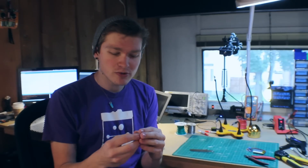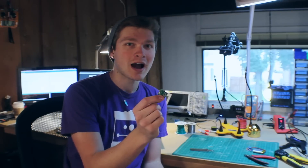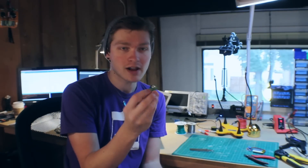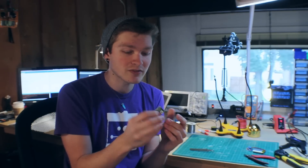It works pretty well, but this sensor isn't giving me anything. I tested it with propane and smoke and got no readings. There are two pins, A and B — A should go high when there's some pollution, and both should go high when there's a lot, but I got nothing out of either. There are some other pins I soldered a little header on, so I'm going to probe them with my oscilloscope to see if there's something else I can get out of it, because the standard interface isn't working. I'm going to probe around and see if I can pull something off the board that gives good output.